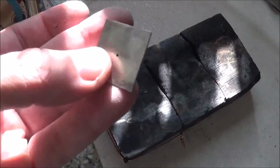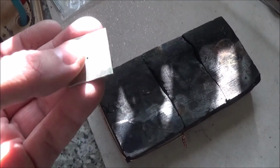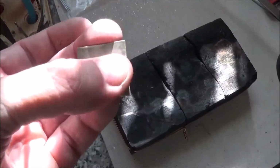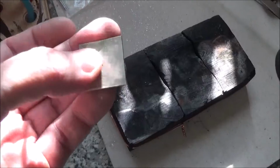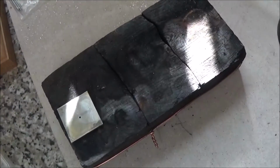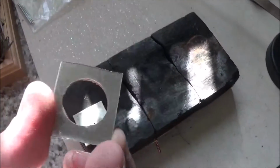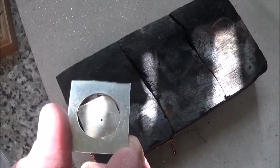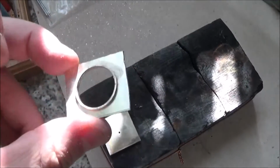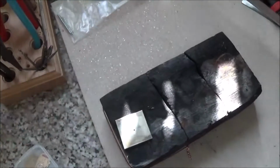The front side is going to be the dial. This I'm going to buff, so it will clean up, and I'm going to leave it like a matted finish on the front, but on top of that is going to go this one there on the top, and I'm going to drill holes through so that they line up perfectly before removing excess material from this and excess material from that.